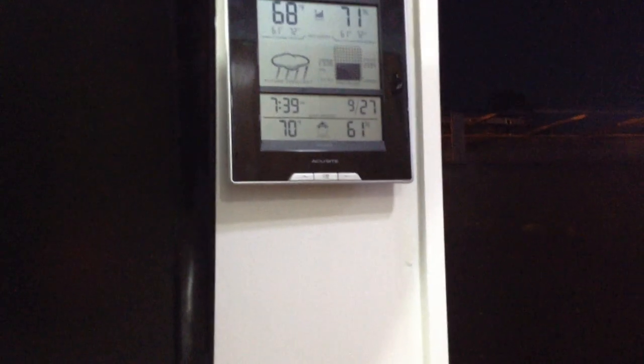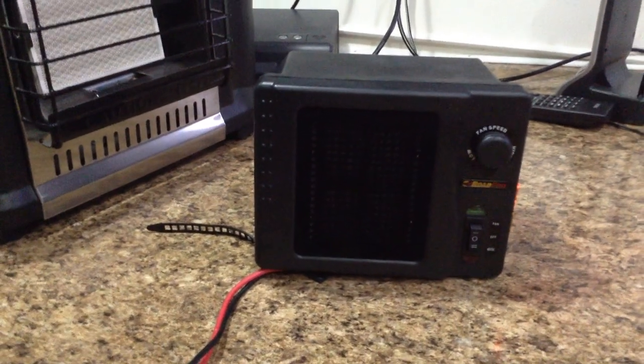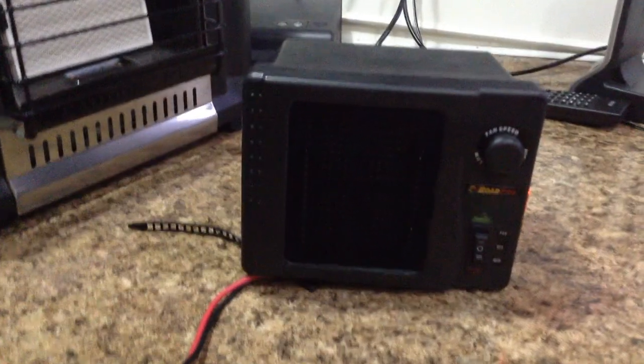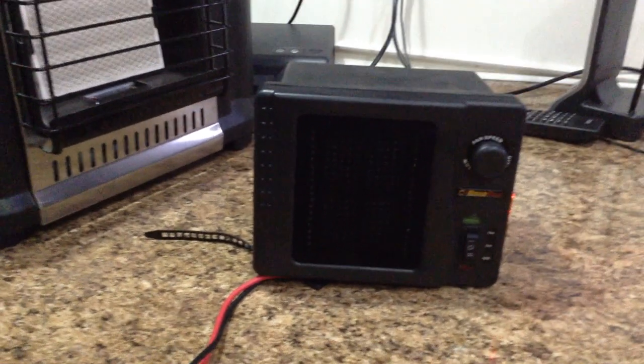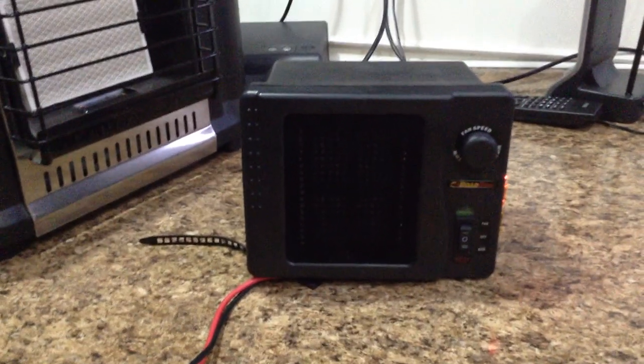Right now it's 61 degrees outside. I've got 70 degrees inside with the door wide open and it's dark out — we're not producing any more solar power right now, so I'm strictly running off the batteries. I'm doing a little bit of a drawdown test with most of the lights on to check livability. I would probably be able to run things for a couple of hours.